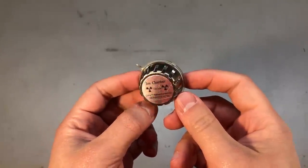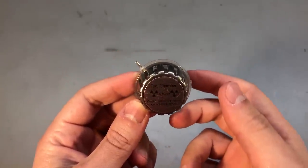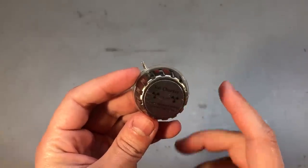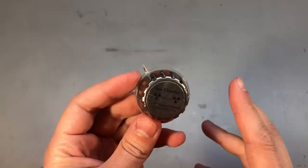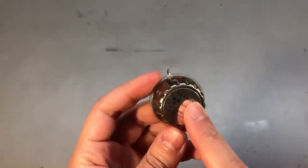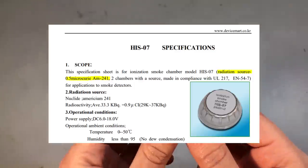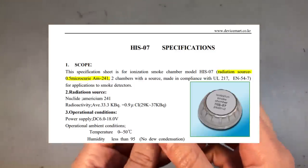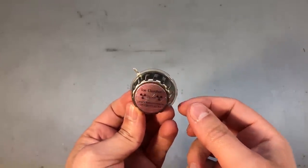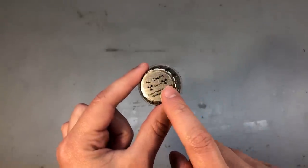Next up I have the NAP07 ion chamber smoke sensor. I don't plan to use this as a smoke sensor — when I ordered it I was mostly wanting a source of radiation to test against a radiation detector. I was thinking I could build one of those classic circuits using a Russian detection tube and build a Geiger counter, but I'd have nothing to test it against. So I ordered this smoke detector knowing it contains small amounts of americium-241, which is radioactive and should make a Geiger counter go crazy if placed right next to the sensor. Old dials with glow-in-the-dark markers are also a good source — those usually contain small quantities of tritium or promethium. This will have to wait until I build my Geiger counter and will be stored in my lab; there's no associated risk because the radiation that escapes more than a few centimeters from the source is usually lower than background radiation.